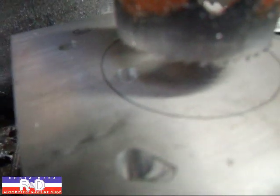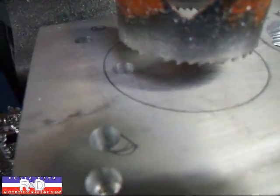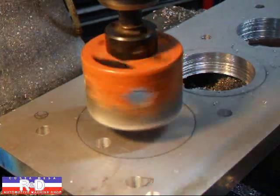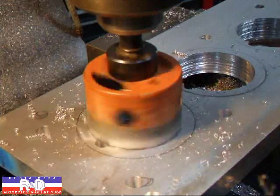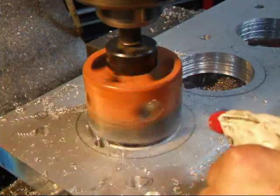I've already drilled a hole on this last piece I'm going to cut, just to show you how this is done. Once you get your hole saw centered, you can go ahead and mill it out. I'm going to use a little cutting oil in here.